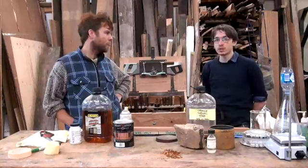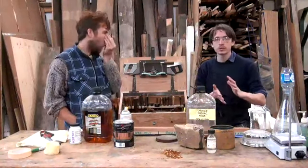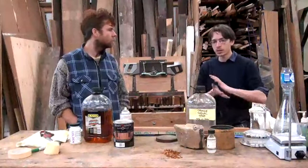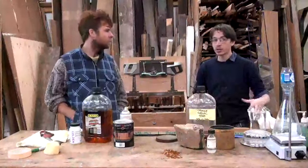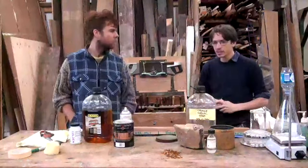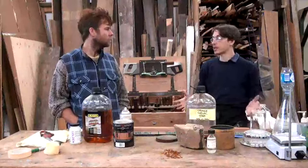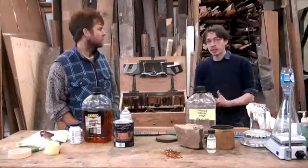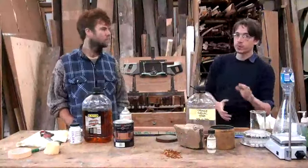Which I do want to say, if you're working with old furniture, I would avoid removing the coating that's on there. If it's lasted a really long time, it'll continue to last. If you can clean the grime and get a nice clear coating on top, and just put a wax over it, that's often better. I work with another restorer who said he'd been in the industry for 12 years restoring old furniture without ever stripping or sanding anything back, because he was able to work the surface, get it beautiful just by cleaning it, or with a shellac surface, reworking it. Right. So if possible, I would avoid removing it.